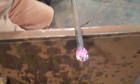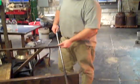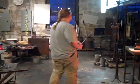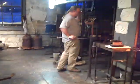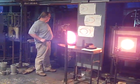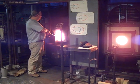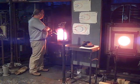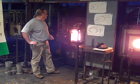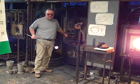So we'll head back over to the furnace. As I stand, I push forward, step out, slide back, keep turning, and into the furnace. So once again, it's 3 turns in the glass. Rest on the shelf, raise up, push forward, touch in, turn 1, 2, 3, up to parallel, lift and come out. Keep turning the glass steady and even.